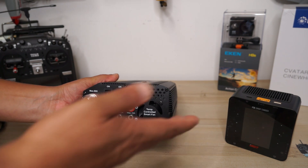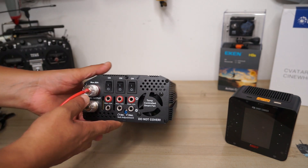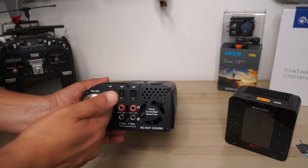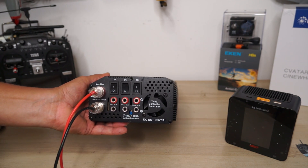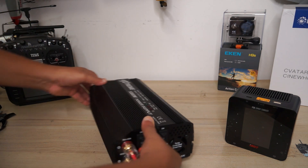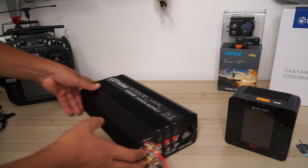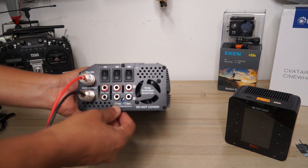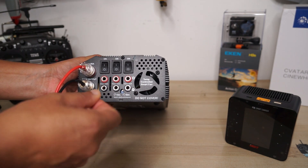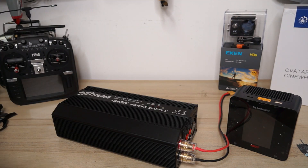Mostly I'll be charging at 10 to 15 amps maximum. Here you can see three on/off switches and three more channels which can give you a maximum 10-amp output each, so you can connect three more different chargers to this power supply. If you're not going to use more than 10 amps, these channels will provide enough power to those smaller chargers. That means you can use four different chargers and charge lots of batteries together. There's also a small knob that you turn with a screwdriver — this is the voltage adjustment.